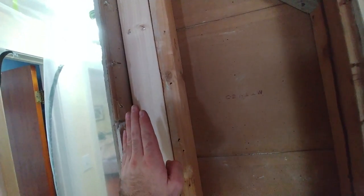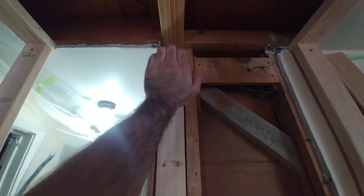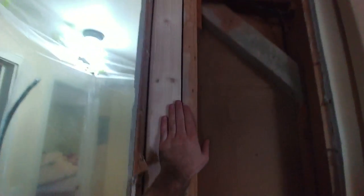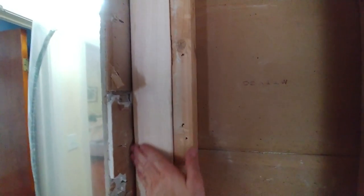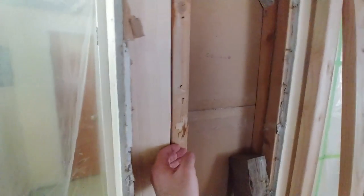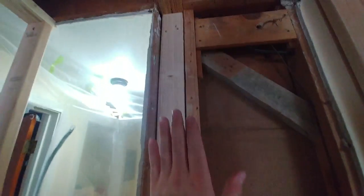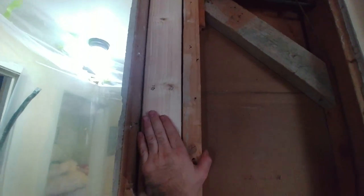And then we did, like I was saying, we put one 2x4 in, and then a rip of 1/2 inch plywood, and then another 2x4. And so now we have 3.5 inches of purchase underneath the end of this beam. It's coplanar with our wall that's flying in from this direction. And ultimately, we will just use it to strike and cut off this extra wallboard, and our new drywall will go on it, and it'll be finished. So that was a matter of adding in timber of the appropriate length until we got to flush.